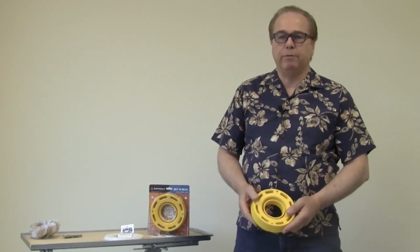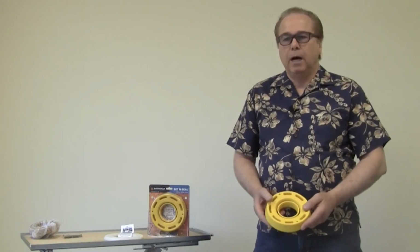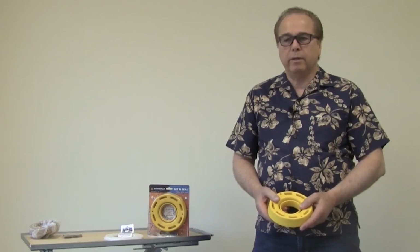A standard installation is predicated on the floor flange being flush with the concrete floor or being mounted on top of a subfloor. On that subfloor there will be a 1/2 inch particle board, then vinyl flooring. With ceramic tile, there will be 1/2 inch backer board over the subfloor, then ceramic tile. Finally, with the subfloor, there could be a 3/4 oak flooring nailed over the subfloor and around the floor flange.